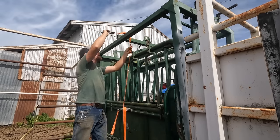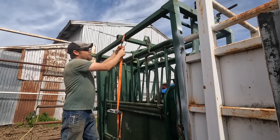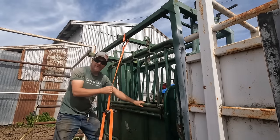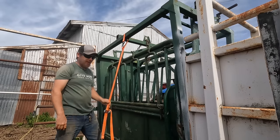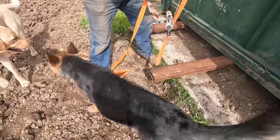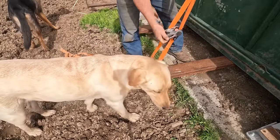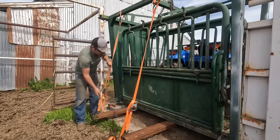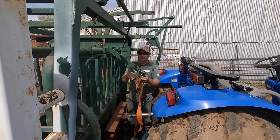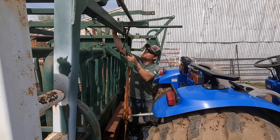The best way to do this is to put the straps high up on the frame so they have the most leverage. If the chute wants to fall, the straps are a lot stronger holding it high up — down low the chute would have more leverage and be more likely to break them. I'll hook to the end of my homemade pallet forks and tighten them down. Having the chute tip off backwards isn't life-threatening but it's not preferred either, so I'll put a strap up at the back as well.